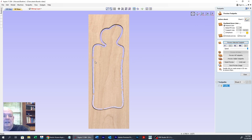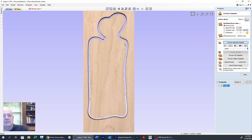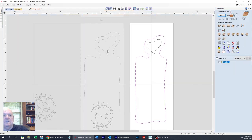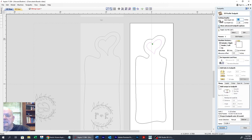And then there's our tabs. And we see we got it cut. Now we got to cut the inner part. So we're going to close. Going to go back to our 2D view. Let's click the inner heart. Let's go up here and we're going to cut that out. Same distance, same end mill, but this time we want to be on the inside because now we're cutting inside